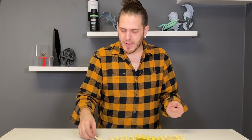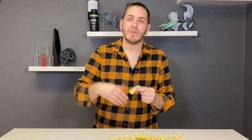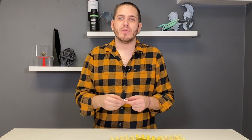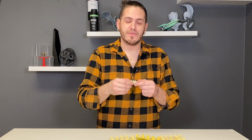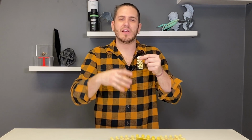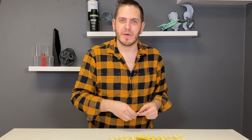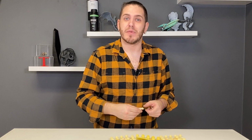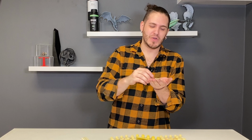I know it's disappointing, but the reason for it was because I didn't have a bar on the bottom. So I will most likely be revisiting this in a future video when we get our hands on a DLP machine, which is going to be more accurate anyway, and we'll just use up whatever yellow we have left for that. Without the bar, all of the spacing was lost and the results would have been kind of irrelevant anyway. Plus it would have been 10 times more work, and I didn't have a whole lot of room in my flask. So there's all my excuses. Let's get back to the actual casting quality.